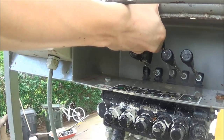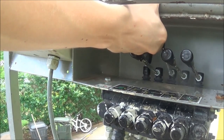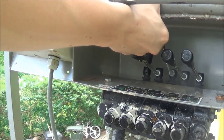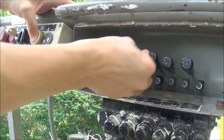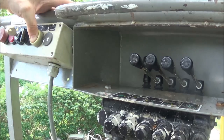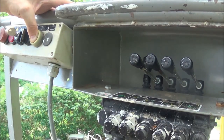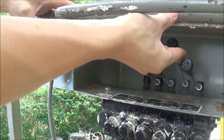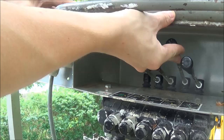And it does say the working height is 34 feet. But it's a little bit more than that. I think it's like 42 or so. And as you just felt there, it stops you from going over your tip limit. There's a circumference around the machine that you can go, and it knows it, and it'll stop you from going over it so you don't tip. So now that we've hit that limit, we'll use the second boom here. As you'll see, it's gonna still level out the machine here.